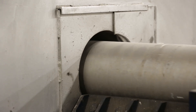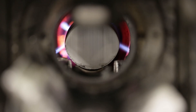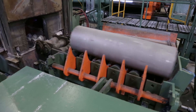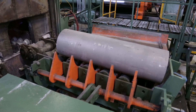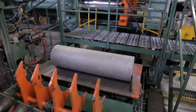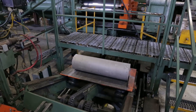The log or billet is fed into an oven which heats the aluminum up to around 900 degrees Fahrenheit. This brings the billet to a plastic state where it is malleable under extreme pressures but not molten. The log exits the oven and is sheared to an extrudable length, usually about 30 inches depending on the shape being extruded.